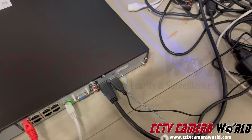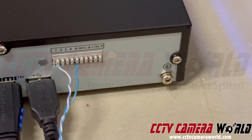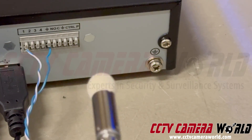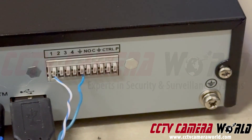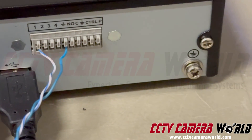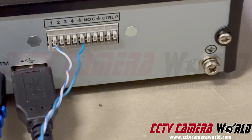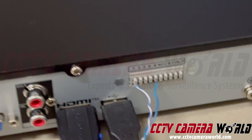This two-lead wire here is connected to the alarm input. I have the striped wire connected to terminal one, and the solid wire connected to the ground. You want to make sure your wire is secure so if you tug on it, it doesn't come loose. Make sure you strip the wire so the copper is inserted securely — that's the most important thing.